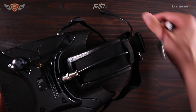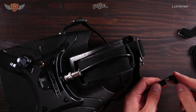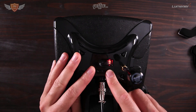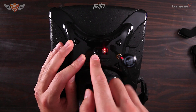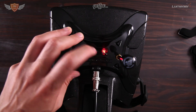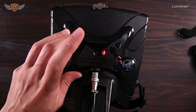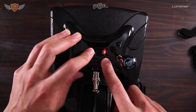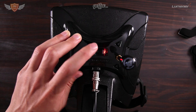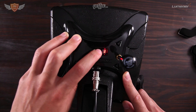This little cable that comes out of the goggles is what you use to power them up. Plug it in and you'll see it lights up. Once lit up, you'll see it's on channel seven. If you press the button quickly, that's how you change the channel from one to eight. If you hold it in a bit longer, it jumps to the next frequency band. So you can cycle through frequency bands — you saw it on number three, then holding again moves it to number four — and each band has channels one through eight.